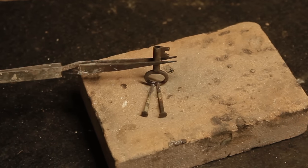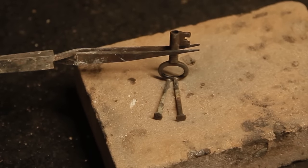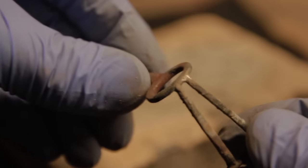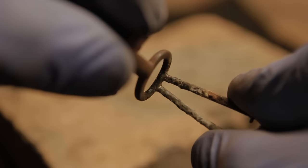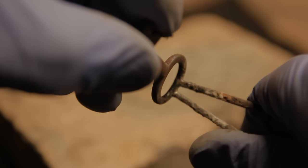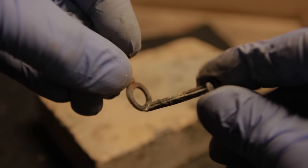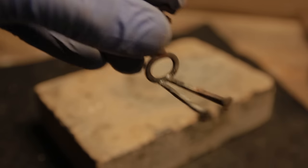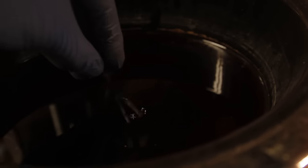Let it cool. Do not put it in water or quench it like you might do with other metal projects — you want to let it sit and cool on its own, and that's going to make it good and strong. And here's the joint. With the 56% silver solder that I use, it makes an extremely tough joint. I'm squeezing this right now and it ain't brittle — it's got flex to it. I really like this product. Now the piece is crusty with flux and oxidation, so what we're going to do is put it in a pickle. I put my pickle in a crock pot, turn it on, and let it warm up.